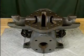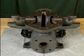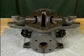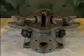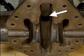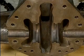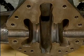In addition, the casing forms the volute and provides connection points for the pump's suction and discharge piping and other necessary fixtures. The volute is part of the casing structure. It's the area around the impeller that creates a gradually widening channel, which is connected to the discharge piping.